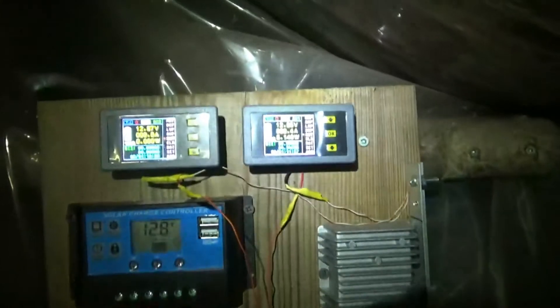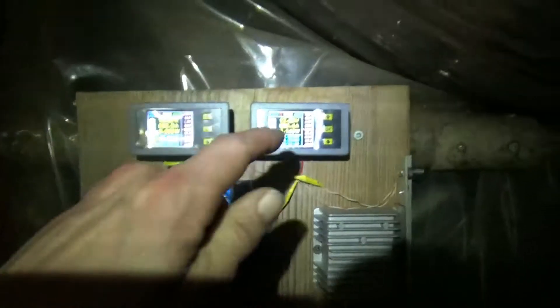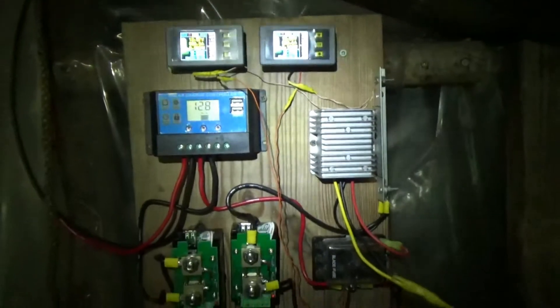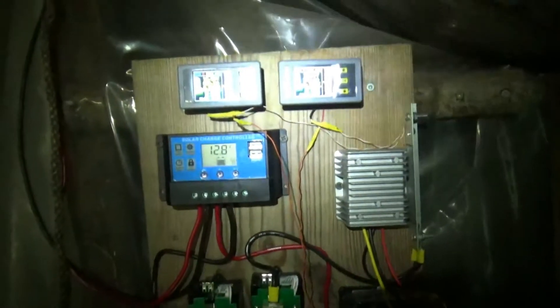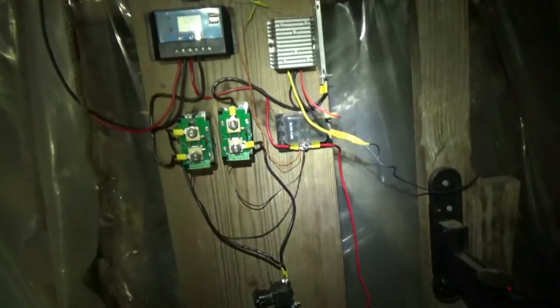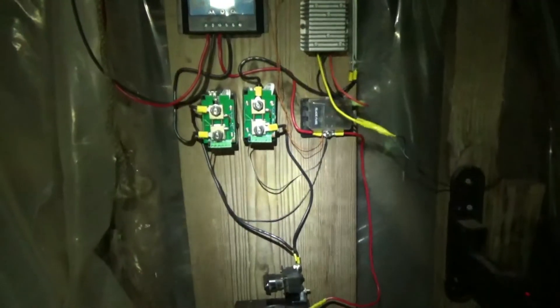These are pretty cool meters so far. I just got them up and running about half an hour ago, so as to their longevity I can't speak. These are set up in the wireless mode — you'll notice this one is on wireless channel AO1 and this one is on wireless channel AO2. These are a Bluetooth type connection, good for up to 10 meters apparently. My intent later on is to take these and grab the data coming off of them and import it into the database on the Raspberry Pi over here, and collect that data so we can actually monitor solar usage and power in the database along with all the other data we're collecting. It's set up right now to collect temperature and humidity data, but eventually it's going to control all the inputs and outputs for the greenhouse and probably also track with the solar panel.